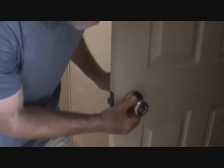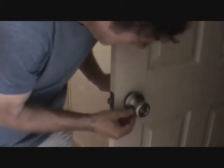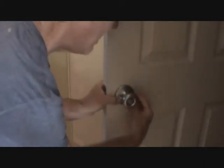And the screws, I just line up. And if you want, you can pull this out just a little bit. You don't want to pull it all the way off the shaft. Then you can kind of see in there where it goes. You should be able to get that started just with your finger. And if you can't, then chances are you don't have it lined up exactly right, because these threads are very fine threads.